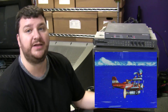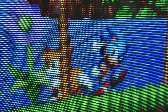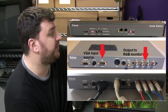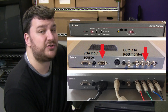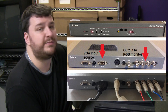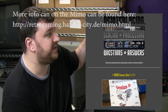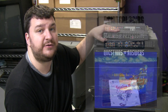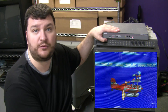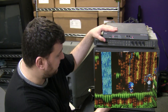What you guys really wanted to see is 240p into an RGB monitor. This is done by taking the 480p VGA output of a computer and putting it through a downscaler. This one is the Extron Super Emotia, but they have different models available that can do this — the Extron ones are pretty hard to find. There's a brand called Mimo that makes something called the Genius 2 that would accomplish the same thing. And while they're very expensive, it will work with any 480p VGA signal, which means if you can get Sonic Mania on a device that outputs 480p component video, you could do a component to VGA converter into this onto your RGB monitor.